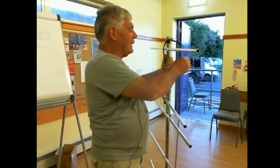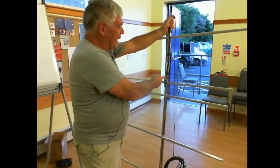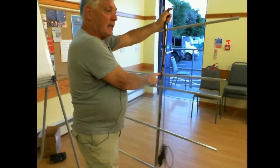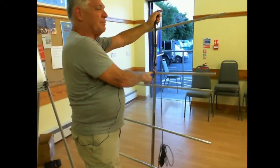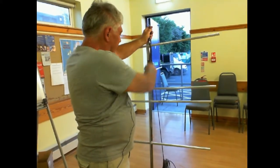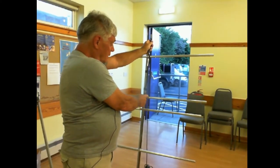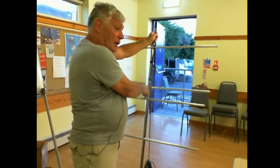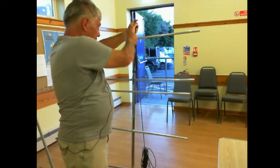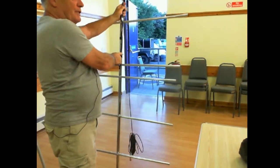somebody was asking about that again, this thing called a Pawsey stub. Yeah. This is a length of coax, open at this end, and it's lambda by 4 long, though I think this one wants a bit of tweaking and tuning. But it's a lambda by 4 long, so that if you like, the coax cable comes in and the live side is connected there, but the earth side is connected to the live side of the coax cable, that then goes all the way down there and then all the way back and comes out and is attached to this side. So that is actually going lambda by 2.